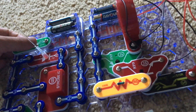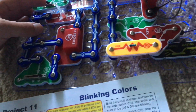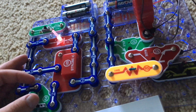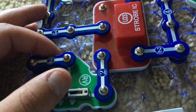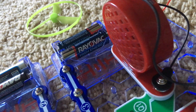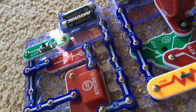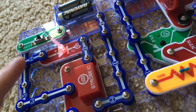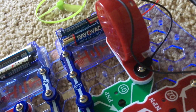Note that the circuit is actually two separate circuits that are only connected by the fiber optic cable. Although it's not very loud, you can hear the speaker sounding, and the sound changes when I adjust the resistor — high pitched and low pitched. The red LED is sending a light signal through the fiber optic cable to the photo transistor, which in turn controls the other circuit.